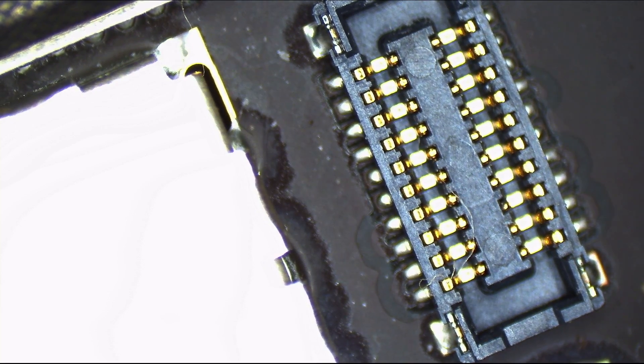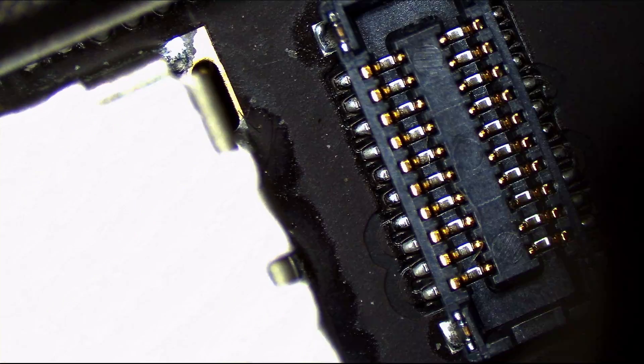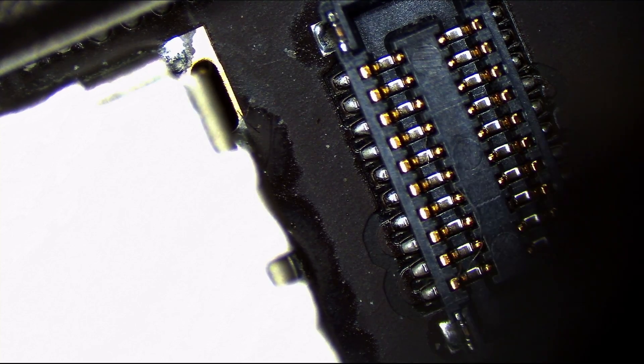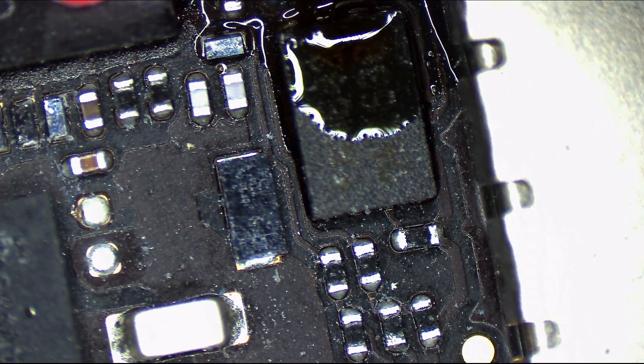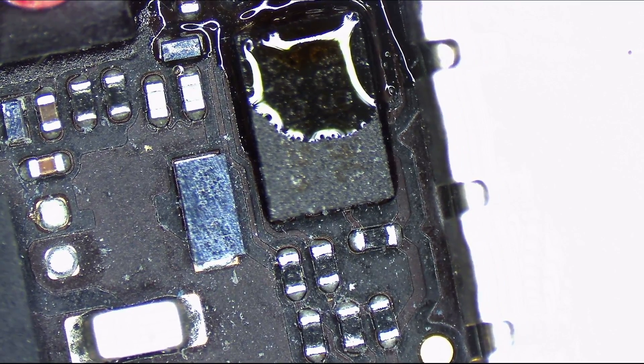That's the beautiful part about corrosion — and this is why pattern recognition is so important. It's not like there's a book written that says how all these things work out. Rather, you just kind of figure it out as you go. So I found out there was a corroded resistor on the ROM. And the issue that I was having prior to that was stuck at five volts — it turns on with 300 milliamps for a few seconds, and then the charger turns off. So when I have that problem, now I deduce that it occurred when the resistor to the ROM chip for Thunderbolt wasn't there.